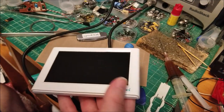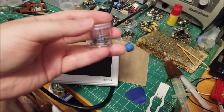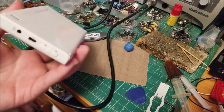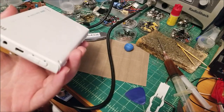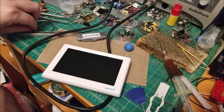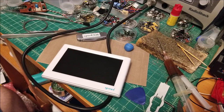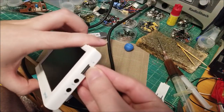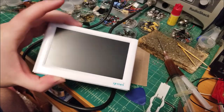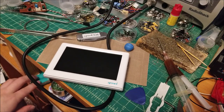So yeah, that was easy. I just have to put in the four screws and this is fixed. For something like 20 switches for a dollar — so five cents each — for five cents in parts and a little bit of time, I did this in real time in this video and we're just about at 16 minutes. Realistically, if you have a little experience in soldering, some flux, isopropyl alcohol, solder, and soldering braid — not strictly necessary but it helps a lot — you can easily replace hold switches or tiny little micro switches in general if you break them when taking something apart. Hopefully you guys enjoyed this semi-quick video. I'll see you guys in the next one, bye!